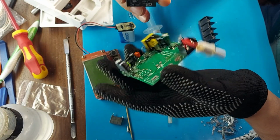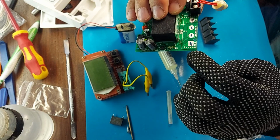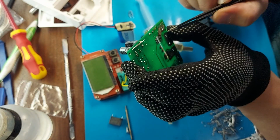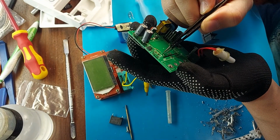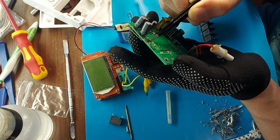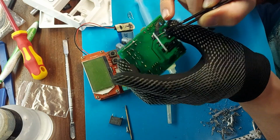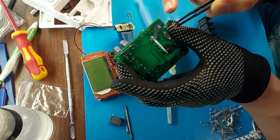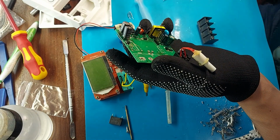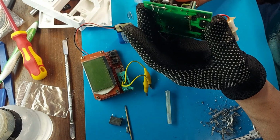Let's figure out why. We have a track here that passes through the board and it should ring. On the reverse side it is here. It looks like there was a loss of contact at this point, and therefore the phase did not reach the diode bridge. That is, this place needs to be properly soldered or a jumper made. You can make a jumper out of wire and then the contact will certainly not be lost, although it may prevent the relay from fitting tightly into place. Yes, I think so. It will still rest on the relay.